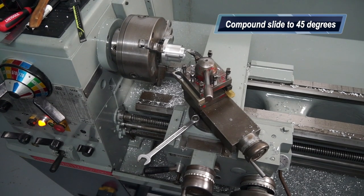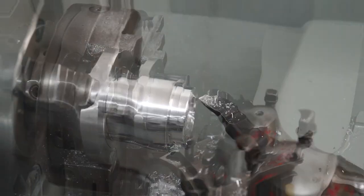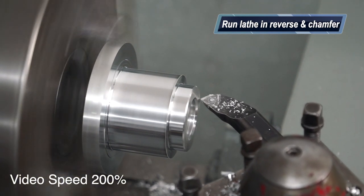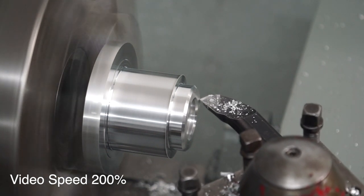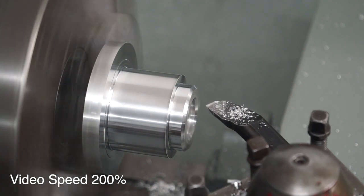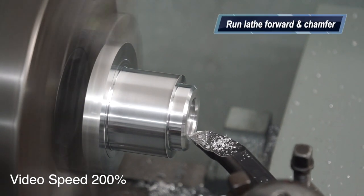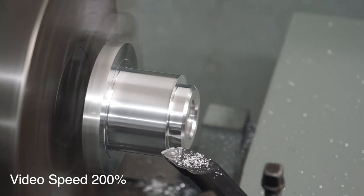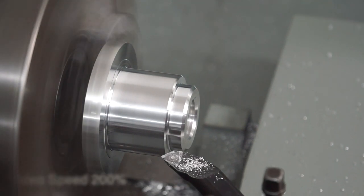I've set the compound slide up to a 45 degree angle and I'm going to use the boring bar to chamfer. You'll notice I've started the lathe in reverse here because I'm working on the opposite side — if you fail to do that you'll usually end up breaking your tip. Taking a little chamfer on the surfaces, then stopping the lathe, spinning it forward and chamfering the internal — just a couple of millimetres — plunging straight in with the tool roughly on that 45, giving a nice little chamfer.